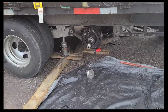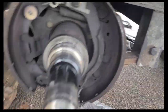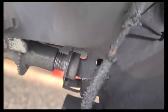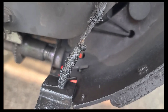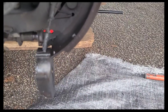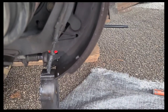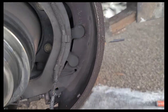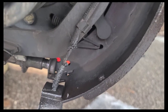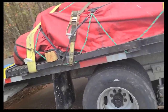We got the assembly off — here's the spindle. You can see where the magnetic brake is laying and look at the wires — see how it's all charred up? That's causing the short. How I found the short was with my meter — I metered it from the 12-volt to ground and it read zero ohms, so I knew there was a short. Because of the short, it burnt up the main power line going back to the power box and burnt that up also.